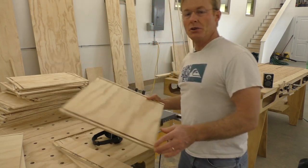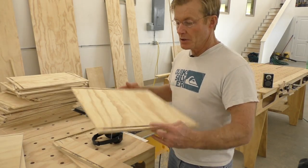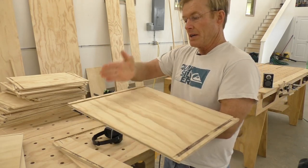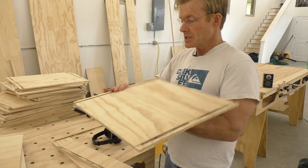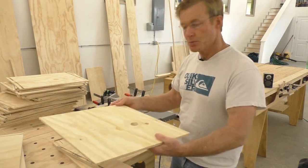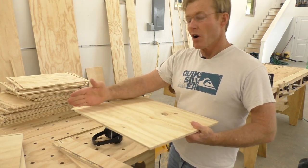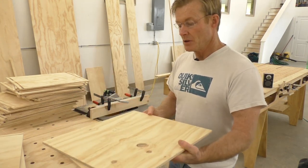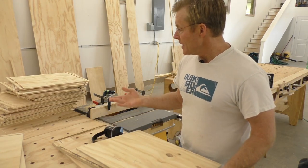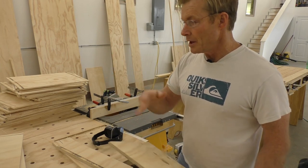When I was doing all these pieces I didn't want to think about size at the saw. The bottom is up because the dados are going to be where the drawer frame fits, and I had all my information on that side so I could see it. When putting pieces through the table saw I could quickly see the marks I made, and I knew I wanted the marks toward the fence. If I hadn't had those marks I might have wondered which way to orient it. Once I got the rhythm, I was able to just push these through quickly, and I'll be able to do the same now.